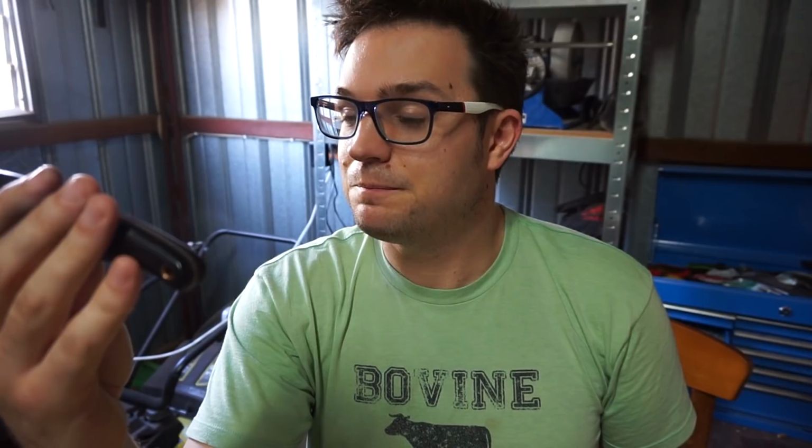It is time to see how this one goes with a bit more of a, well, what I've done so far: I've had initial testing, which I believe was 17 degrees, on a Lansky setup, went up to 2000 grit, and that did 950 cuts. Then I had old mate Jethro over at Knife Support put on a very fine, highly polished 13 degree, I believe, convex edge. And that was the best so far. 1300 times that cut through the rope.